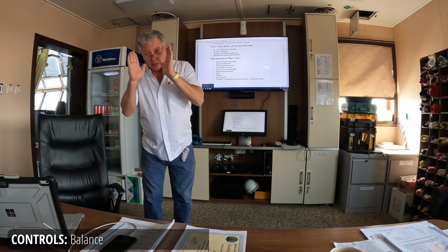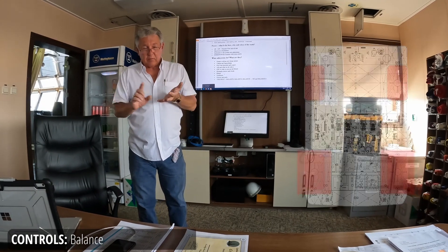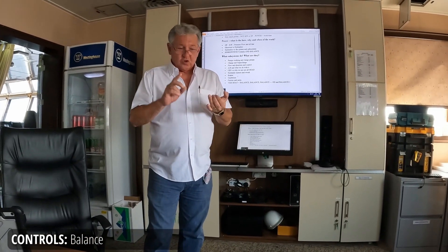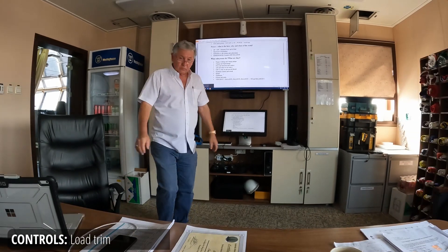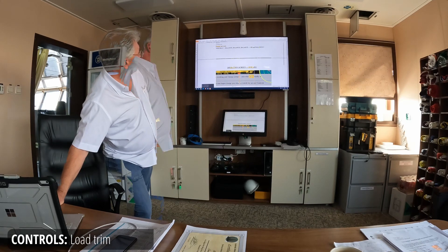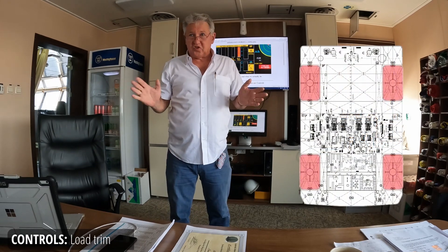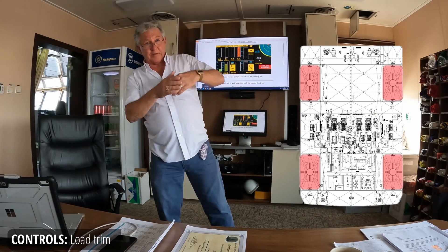If we go bow up and the leg moves to the aft, we're not doing ourselves any favor — we're adding friction, we're adding unnatural forces. This boat should be jacked at full trim. There's two kinds of trim: there's vessel trim, which is when the vessel is actually balanced on its weight, and there's also load trim, where all four legs have the same or similar loading. And more importantly, there's a diagonal.